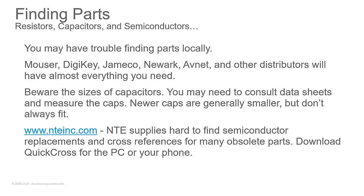Normally, you don't have to deal with that. Normally, you buy caps, you get them in 105 degrees Celsius. If they're a 16-volt part, you put a 50-volt part in it. It doesn't matter as long as it physically fits. And today, 50-volt parts are the same size as 16-volt parts, sometimes even smaller than some of the 16-volt parts, depending on the manufacturer and the series. But always stick with 105C caps when you're dealing with monitors. And make sure that you install them correctly so they don't go pow.